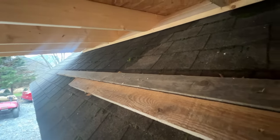Alrighty, man. That one hit home. I don't see the screw sticking out the sides anywhere. It sucked the band board up super tight to the rafter and even sucked it down to the roof a little bit, so I'm super stoked on that one. I think that's going great. Just realized too that I probably don't need these anymore. These stepper things, these are useless now, so I'll get rid of those. I'll get me some extra screws.